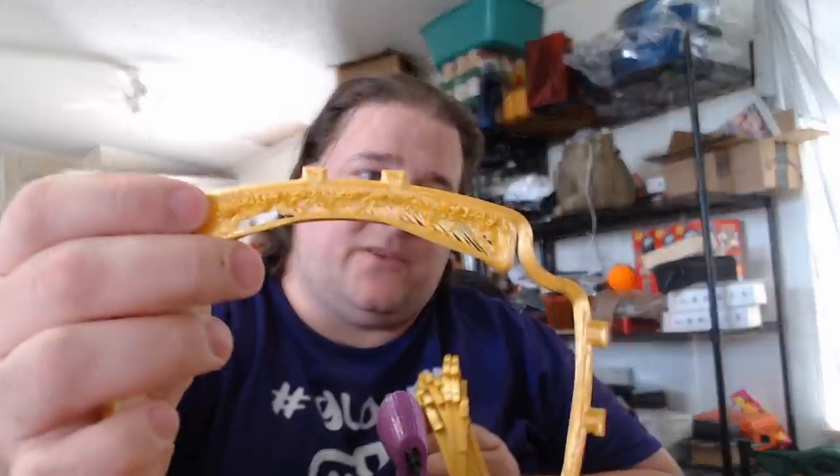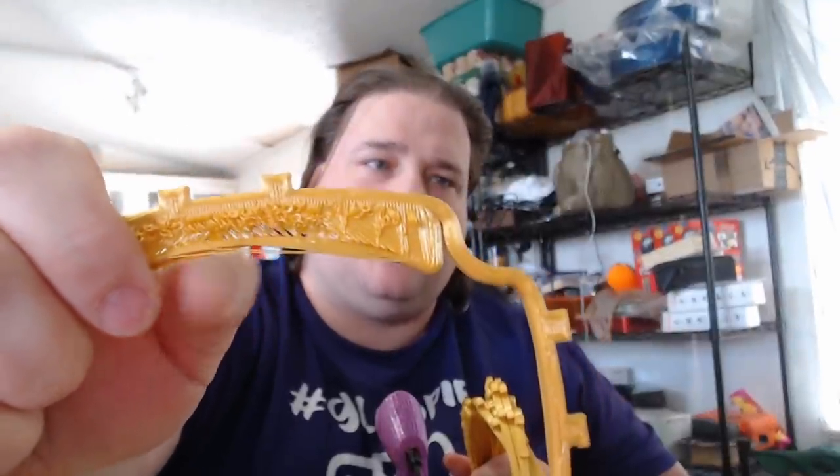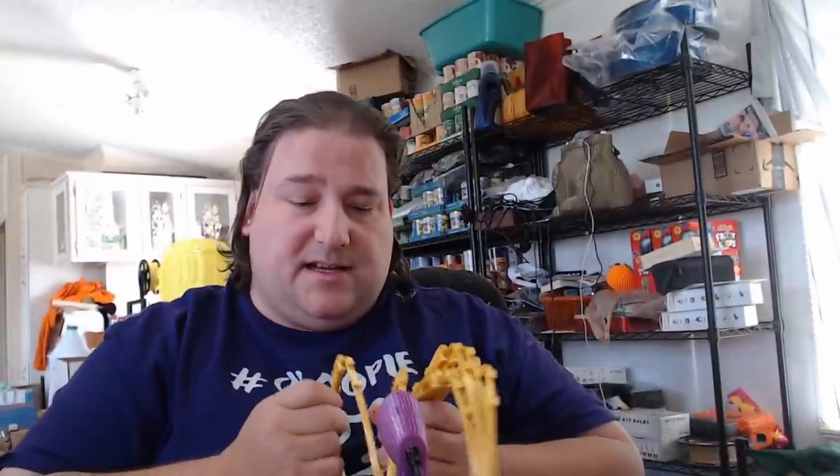So how did it start? I started off printing these and they were coming out messy — my bottom layers were being destroyed. You can see parts where it's not grabbing properly, where the shape is not grabbing correctly. We're going to go over why that happens, how to get around it, and how to fix it. The consequence is these solutions allow you to increase your air gap more than you think you can, which allows hand separation of parts.